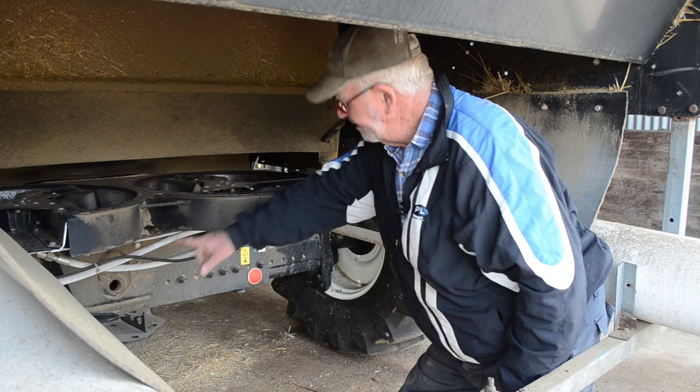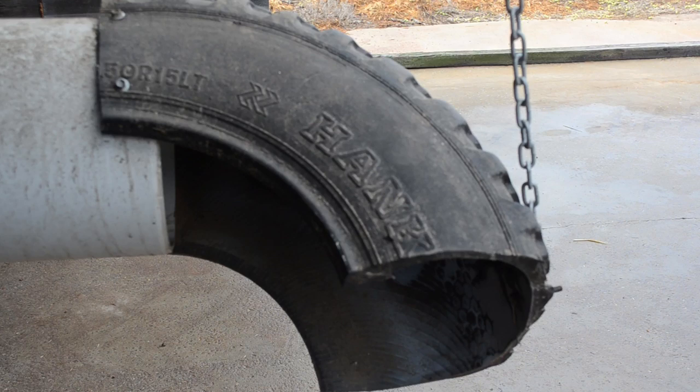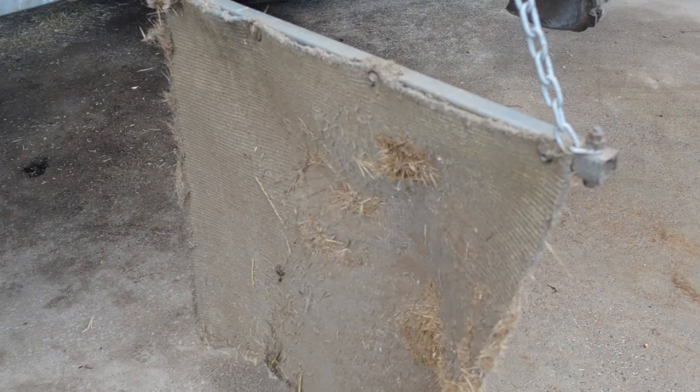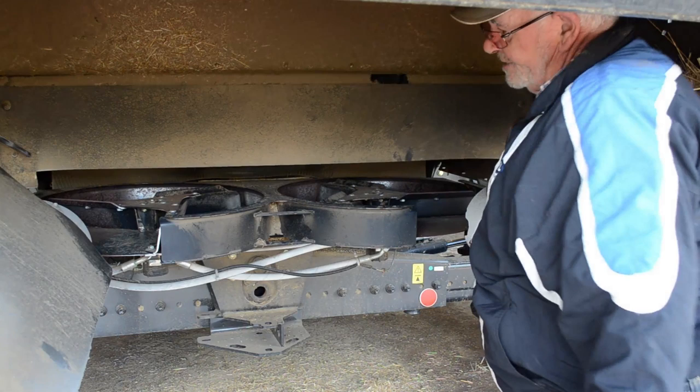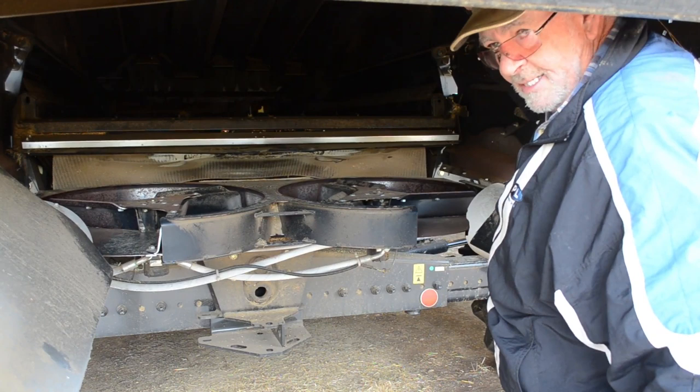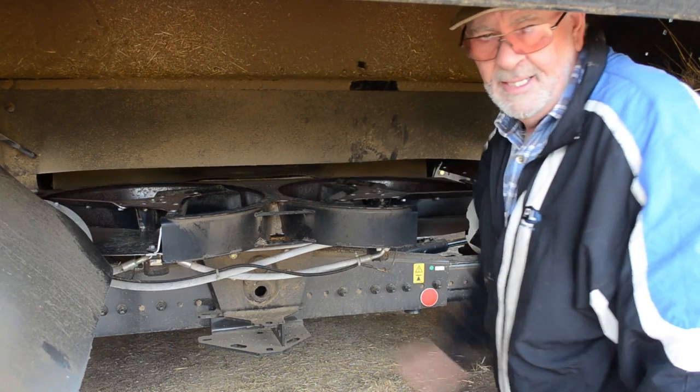We reverse the spinners, change the motor and the blades, swap them over so that it directs all the chaff and fines straight out these 300mm PVC tubes. There's a bit of carpet just to help with the wind so that the chaff stays on top of the straw. As you can see there's no major cost. This flap, which comes standard on CX 8080s, is the most important part — it means that everything that comes off the sieves must go into the spinners and is therefore directed back on top of the straw.